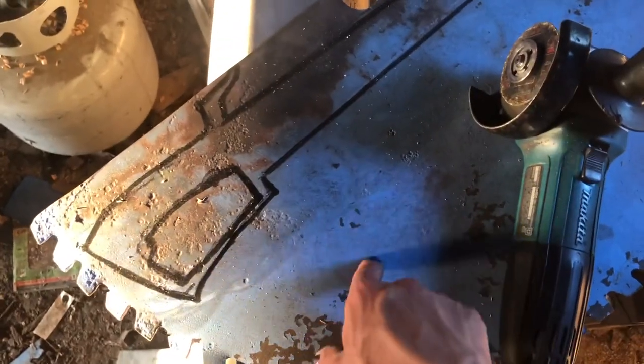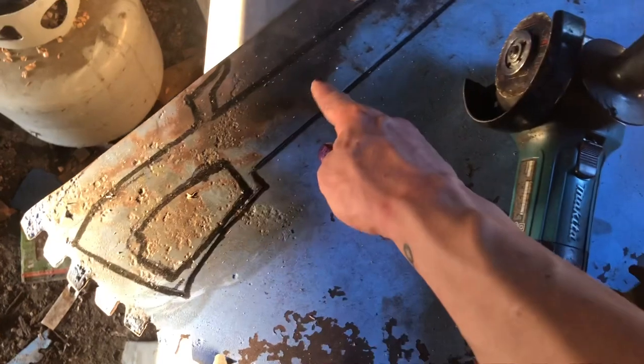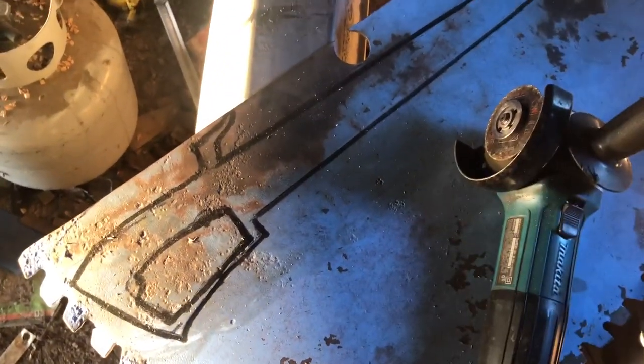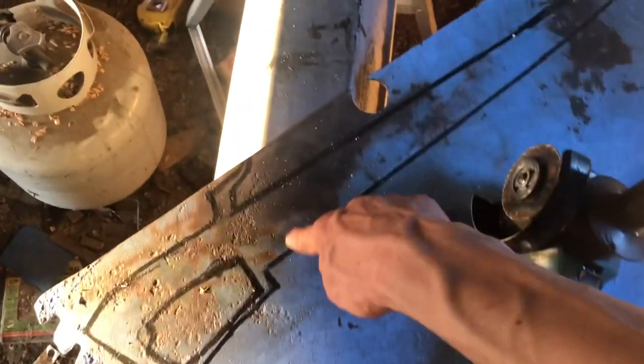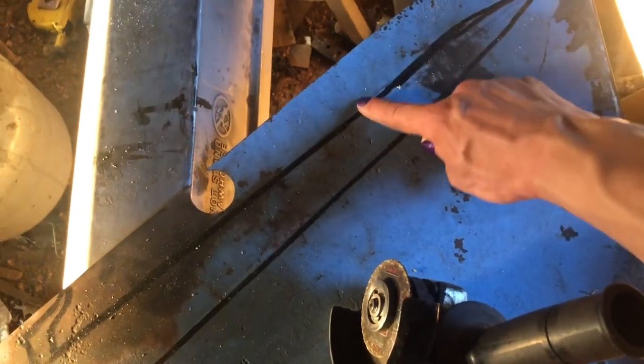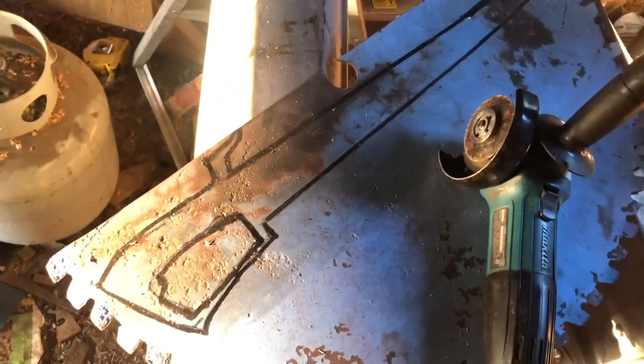The rest of it really isn't a big deal, because this part had to heat up anyway so I can drill holes for the handle, and that's the other part where I actually need to hold an edge. Along this line here, and especially right here too, I might put a small bevel on the back of it. You definitely want the tip of it to still remain hard, so keep that cool as well, to about here maybe. Just be careful while cutting and you should be fine.